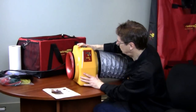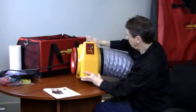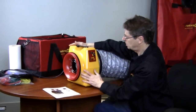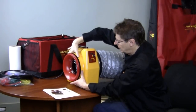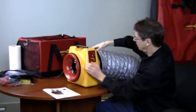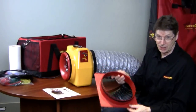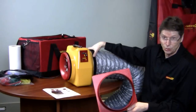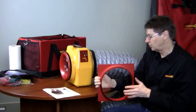The way this duct tester shell is made is a very unique process that allows it to be molded completely in one piece — there's no seam anywhere, no joins anywhere in this duct tester. It's completely molded in one piece using a unique process we've developed, which allows us to put a ridge here that when the flex duct goes over top, it's held in place by this ridge, and the strap pulls it down on this side of the ridge. On the other end of this flex duct is the flange that attaches to the return, and the flex duct comes off just as easily as it did from the duct tester fan itself.